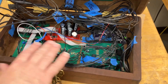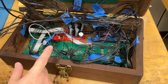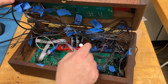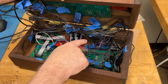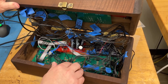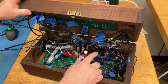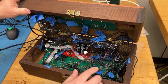The filter cutoff and the pitch are driven by the built-in digital-to-analog converters — I think they're 10-bit or 12-bit. The other voltages are made with PWM. Unfortunately, they couldn't figure out a way this semester to change the PWM frequency from about 1.8 kHz, so there are some filters here — I would like to push those up higher.